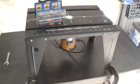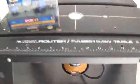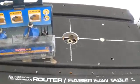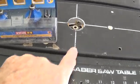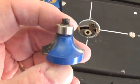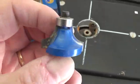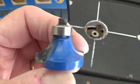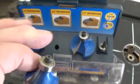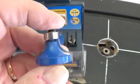The next step involves this scary looking device which is a router table. Now some people can operate the router freehand — I've never been that lucky. Maybe on a big solid piece of furniture, but on small pieces like this it's best to have the router connected to a solid object like this table. The next step is to pick out the proper router bit. I use ball bearing piloted tungsten carbide routers if you can get them, and you want to pick the radius that is about one half the thickness of the lumber you're using. We used three-quarter inch plywood in the perimeter cabinet, so I want a three-eighths inch round over bit.